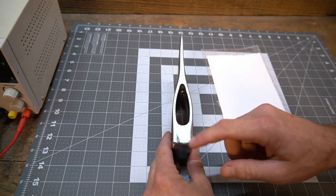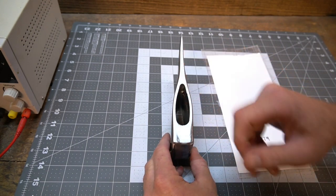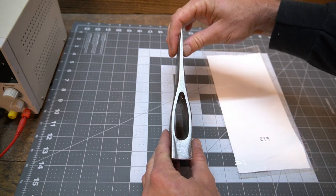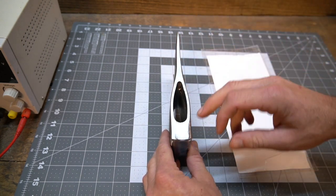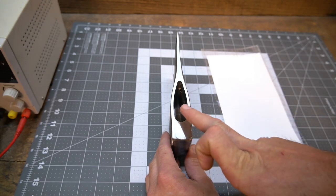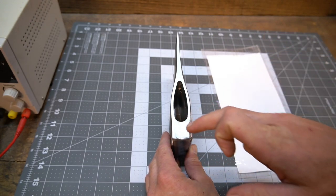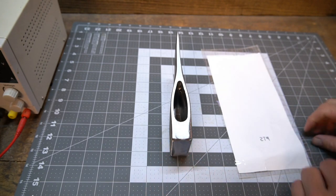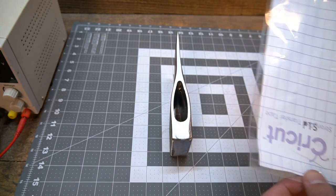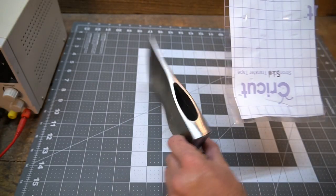So I cleaned up the top a little bit more with 120 to get some of these scratches out. And that's so that the solution doesn't seep underneath the vinyl through those cracks and etch something that you don't want etched. So,